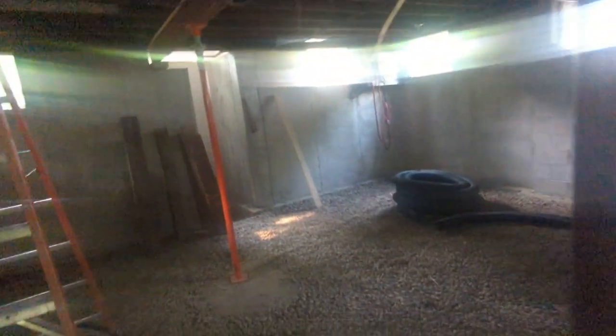There it is. That goes over here. It was there that I cut it off. It went over into this junction for some reason and over to this outlet, which is where the washer was, or the dryer, whichever. I think probably the dryer. So we'll have to rebuild that. However, to some degree we were going to have to anyway, because I don't like to have a junction box on such a heavy circuit like that.